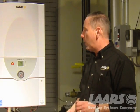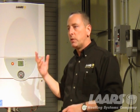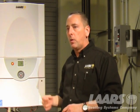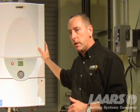All right. Now, one more thing I want to talk about. We talked about an LMC. There's also an LMH. LMH is hydronic version only. All right. With the LMC, it's a combination boiler. We have a domestic hot water flat plate heat exchanger that delivers hot water to your faucets. In an LMH, you can use that with an indirect tank. All right. So if you have an indirect, you want to choose the LMH.